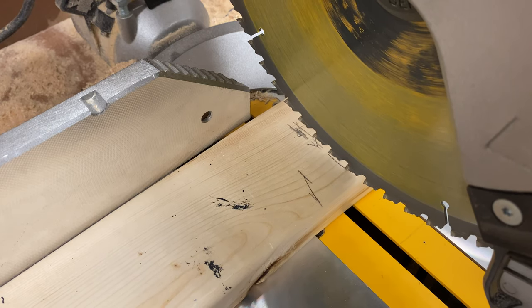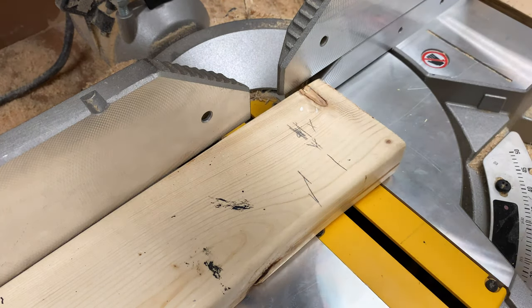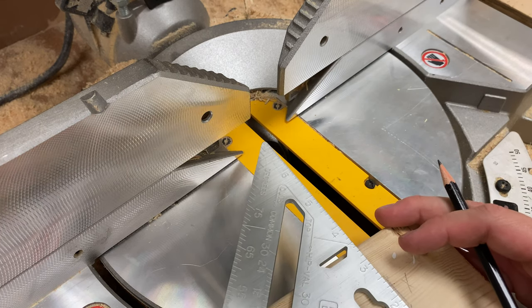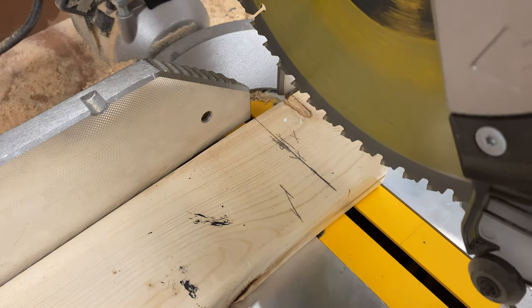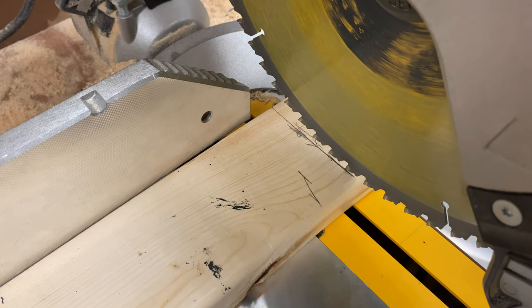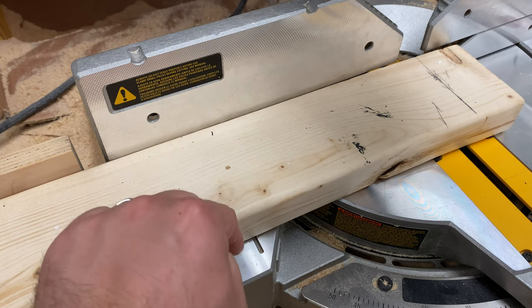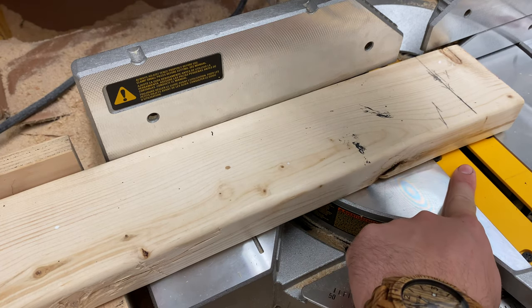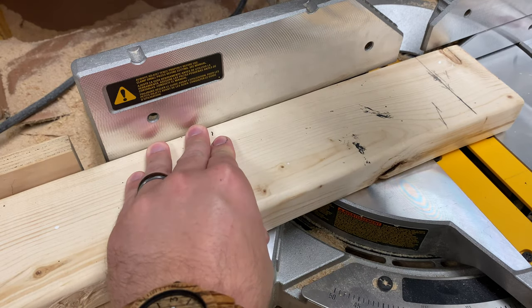As I'm bringing this down and I'm trying to sight, I can do a pretty good job because I've done it a lot — sighting down where that V is. Sometimes you may have a sliding saw or a saw with a laser; that's awesome. If you don't and you need some help, that's where the speed square comes in. I can take my speed square, line it up with my mark right here, make a quick line, and now I've got a line all the way across. No matter where on the board my mark is, I know exactly how to line that up. Once we know what's happening with our mark, we need a hand check. This hand has got to be pressing on the board — we need pressure in this direction as well as the downward direction so that it stays firmly. You do not want your hand choked up right next to the blade. This is yellow for a reason — stay away.